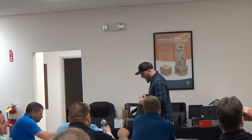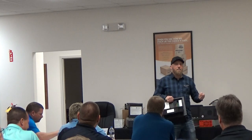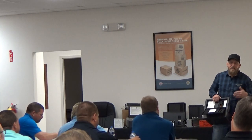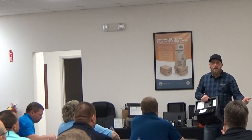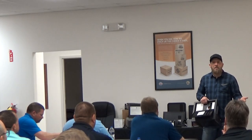And a lot of people like to do a visual look of fuses, but sometimes a fuse can blow and not be such a visible break as some of the others. One thing I do in my hands-on training with people is to separate a fuse to see how it's been blown. It has a black mark in the center of the fuse that's been shorted. The darker the black spot, the deeper the short. If it's a clean break and no black mark, that's from over amperage.